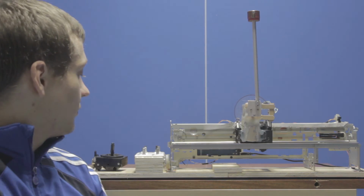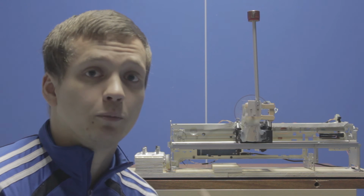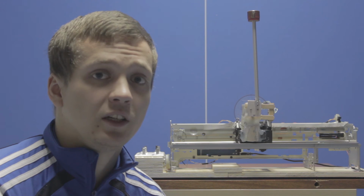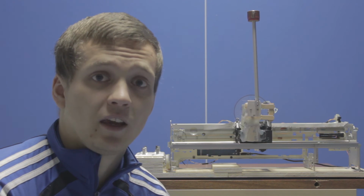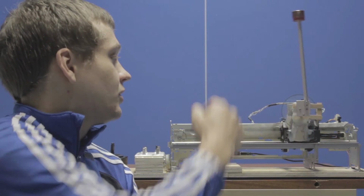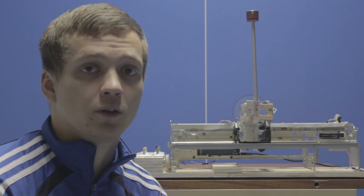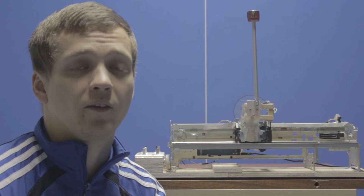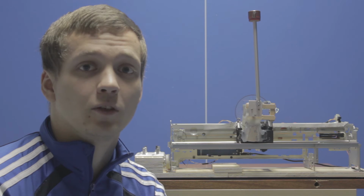So as you've probably seen before when I showed you the potentiometers, there's a 7th potentiometer now that's called lean KD average, and that's essentially the gain for that part. And as you can see, if I bump it now, it will come to a halt much more quickly in the middle without oscillating back and forth forever. Yeah, and that's what I did to solve the problem.